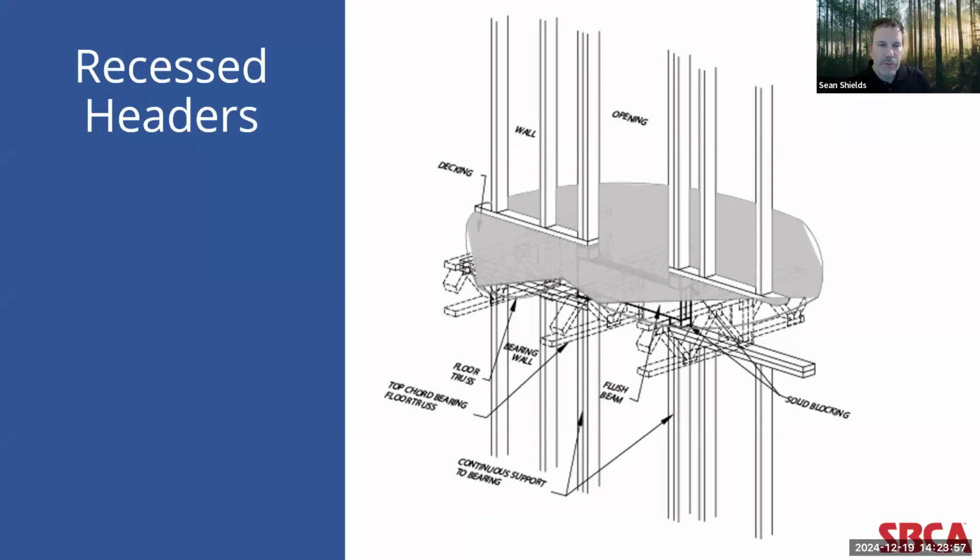Here's another detail that shows a benefit of top chord bearing trusses. They can be used to enable building designers to upset a rough opening header and incorporate it into the floor system, in this particular case for an interior load-bearing wall. Sometimes where you'll see this are entryways into multifamily units from an interior corridor or hallway. In this case, the building designer may want to move that header into the floor to accommodate either a taller door or a window above the door or some other design element. Again, that top chord bearing condition allows the building designer to move the bearing up into the floor system itself and create more design flexibility for that rough opening.